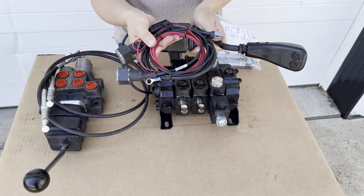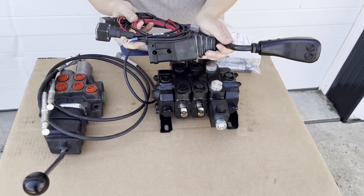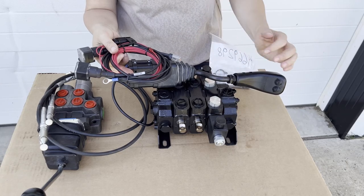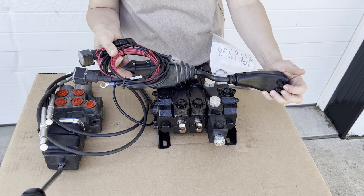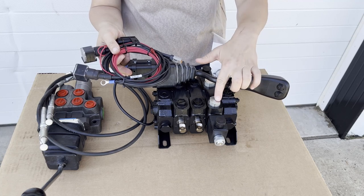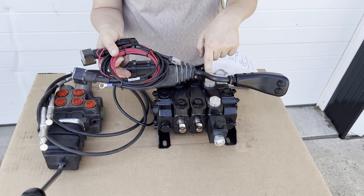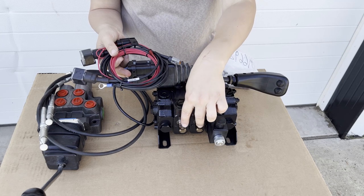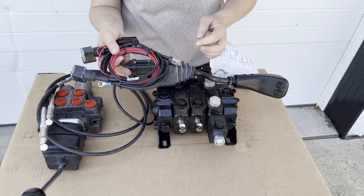There's also a wiring harness with this setup that's connected from the joystick to the valve. The wiring harness is communicating just with the electric section of the valve via the buttons — that's not related to movement of the joystick, it's just whether the buttons are pressed. The pressing of the buttons sends an electrical signal which then moves the spool in and out, which then directs oil flow. In this setup, typically two sections are controlling the loader and bucket, and one is controlling the grapple — opening and closing it.